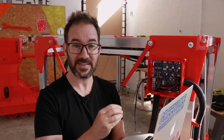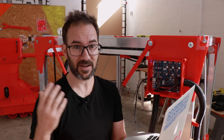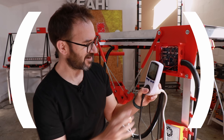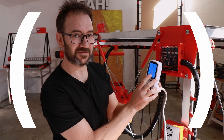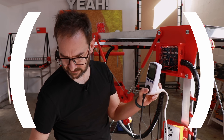Now that I removed the diodes I still have the problem: I cannot run the four beds at once at full power because the breaker will trip. Now that it works, I can measure how much power it draws. The four beds at once is an overload — almost 3.6 kilowatts, which is 16.8 amps, one amp more than the rating of the breaker. So I will switch this off before it trips.